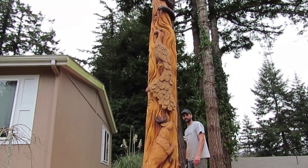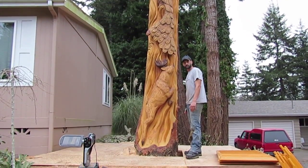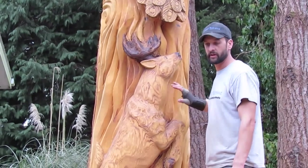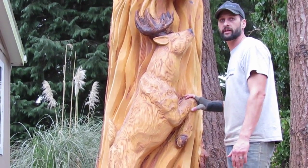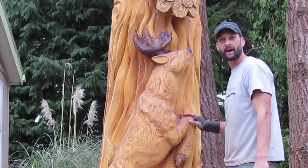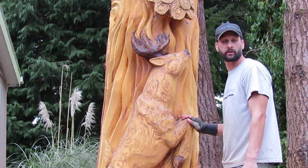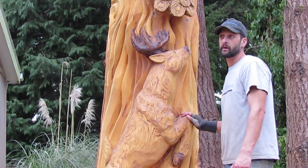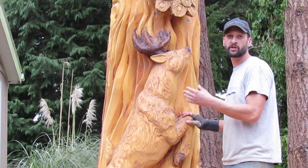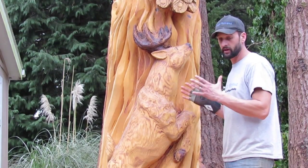I put on a Mesmer's UV Plus — it's a deck finish. It's a good product. It'll help control the wood. The wood was fresh-cut right before I got to it, so it was real green and has a lot of moisture in it. On a piece like this, you kind of seal it up — it'll disperse the water and dry out slower, which helps with cracking. Then, down the road, about a year in, or maybe a full summer season, a year and a half — you apply another coat, then you can put a hard coat on it, which will bring the gloss and bring that out. And that'll basically cap it for a long time.